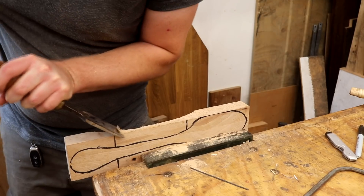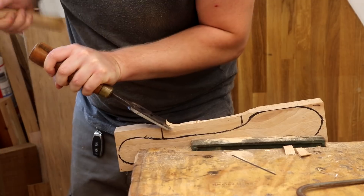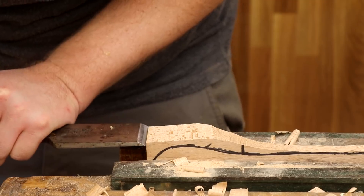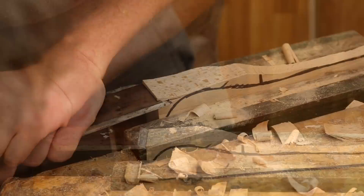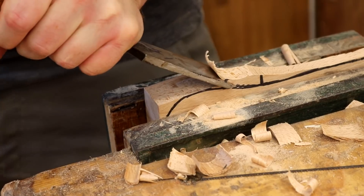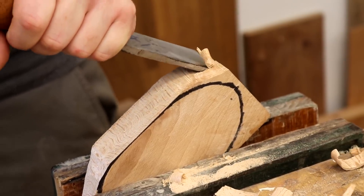To clear more of the waste I used some chisels with a mallet, with the bevel side of the chisels face down. Here you'll see I'm holding the chisel with the bevel up to clear this piece of straight grain, and then I swapped back to bevel down to shape the handle. For some of the chisel cuts it was much easier just to take away a little bit at a time with the corner of the chisel, particularly on the end grain cuts.